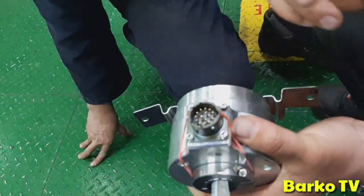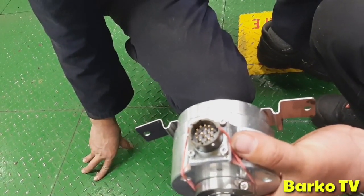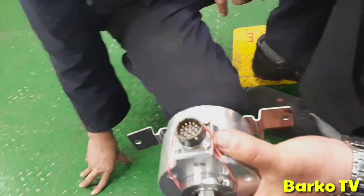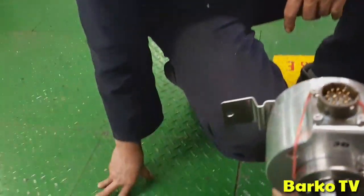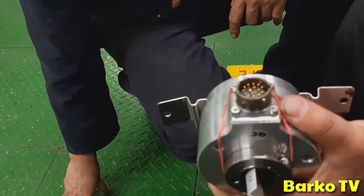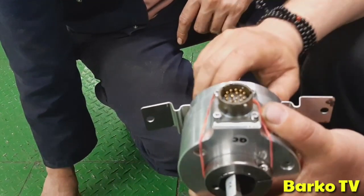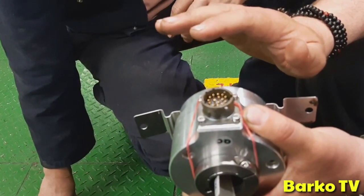I do two things. Of course, I will check that the indicator is showing TDC 1. But sometimes maybe somebody stepped on the pointer, so I don't know exactly where it is. So by turning the engine until the light goes on, I know that when I put this one back on and turn it and the light goes on, it's the same position. You know what I mean?